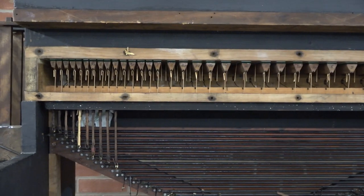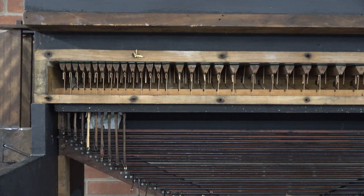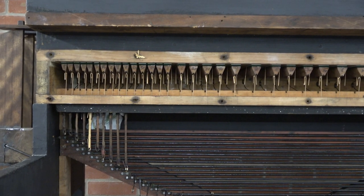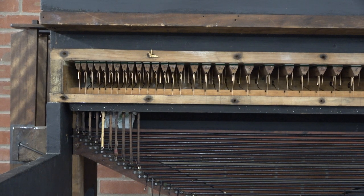You'll notice the second screw hole at the top from the left — I've had to fill that in with wood because the screw just goes round and round. What I'm not going to do is put bigger screws in just because the threads are worn. So anywhere they're going round and round will be properly filled with wood and re-drilled.